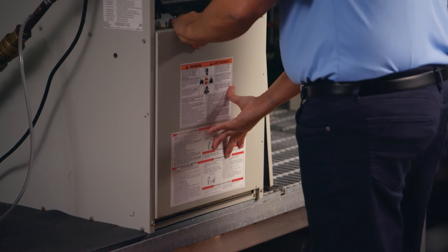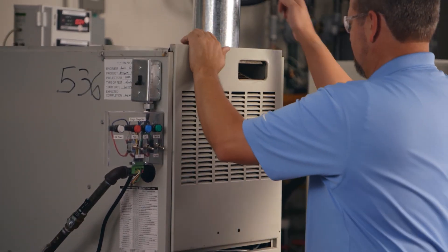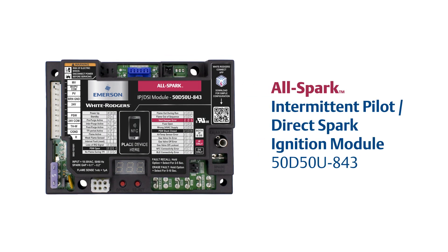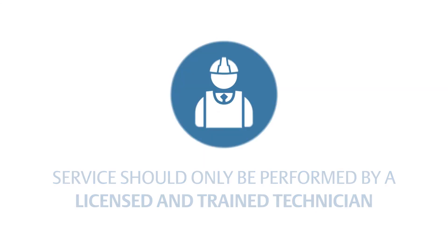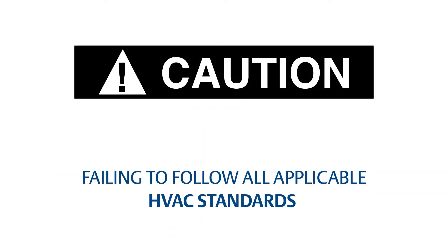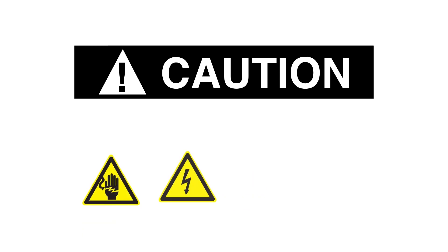Reinstall the access panels. The 50D-50U843 is available wherever White Rogers products are sold. For 24V intermittent pilot or 24V direct spark ignition applications, be sure to stock the 50D-50U843 AllSpark 24V Non-Integrated Spark Ignition Module. Service of HVAC equipment should only be performed by a licensed and properly trained technician. Failing to follow all applicable standards of operation and maintenance, including applicable codes and manuals, can result in potential hazards, including electrocution and fire.